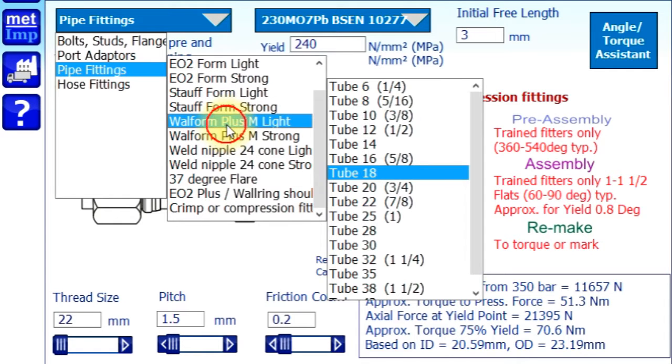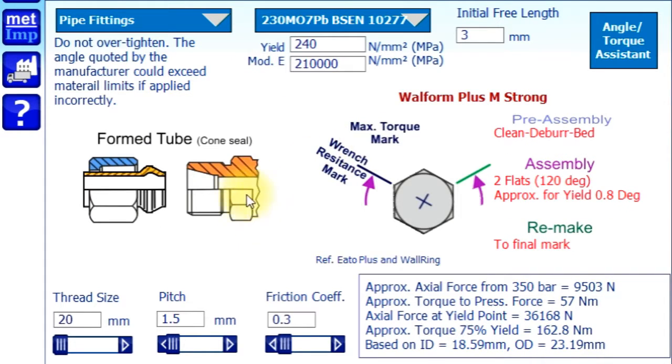But we don't like these older fittings. Because these days, hopefully, you're using face-to-face fittings. A lot of the older fittings have changed — although they've got the same name, they're now shoulder fittings. They're clamping to a shoulder so they don't have any initial pre-assembly, because pre-assembly leaves room for error and fitter errors and not being done properly. So by removing that pre-compression makes the fittings a lot more reliable and they seal better. So you have to be careful because these days you can't put in that quarter turn because there's no shaft length to extend — and they will overstress them.